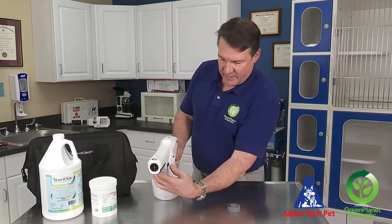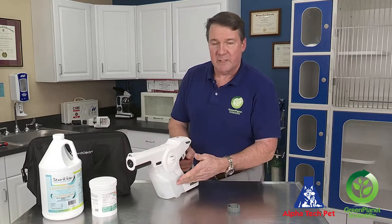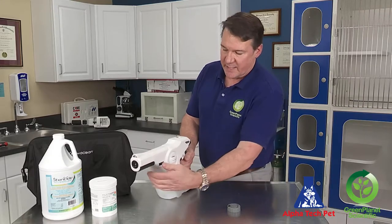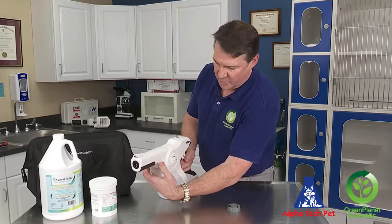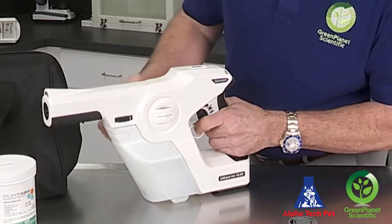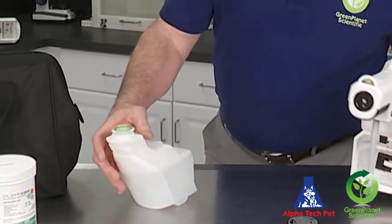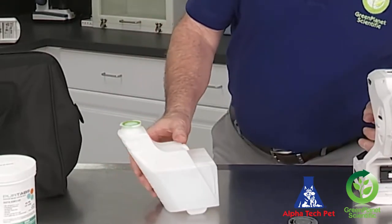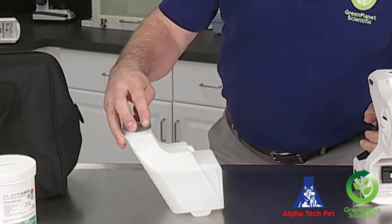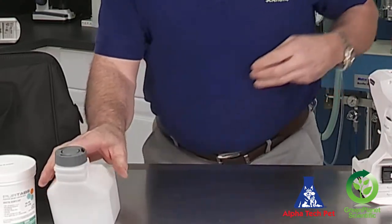At the end of each day you're going to want to take off the tank if you have leftover solution. If not, you're still going to take the tank off and purge the lines. To do that, unlock the collar, pull the ring, and it slides right out. We have some leftover pure tab solution in here — we're just going to cap that and save it for tomorrow's use.